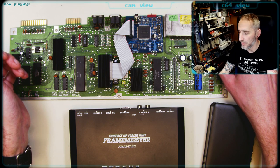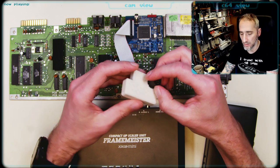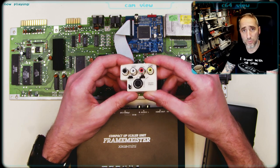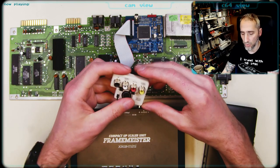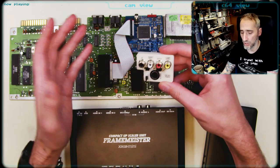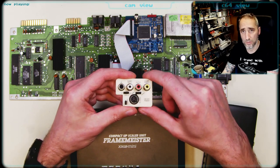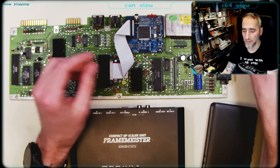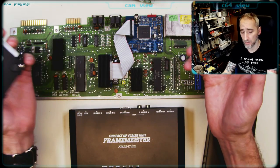And something I'd like to mention briefly is I have used this adapter, which has been designed by Sven Petersen and manufactured by Marty in the Czech Republic, because here I got access to all of the video signals I was requiring for this test, except for the component signal in this special case. And this makes your whole wiring a lot easier, because you are not required to buy custom fitted cables or something like this. It's all Cinch or standard S-Video, and everything works fine, including the audio, including a mono stereo option. So if you have just a mono C64, like a standard C64, then you can route the audio to two outputs, and then those devices are providing a nice centered audio signal out of the box without any adapters.